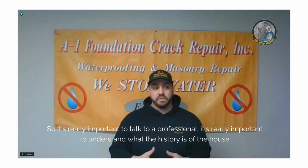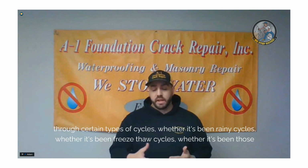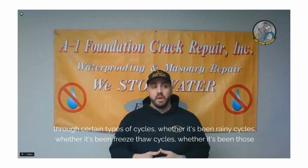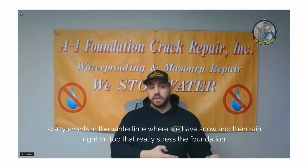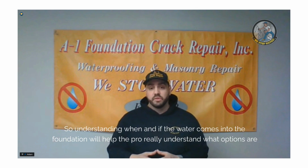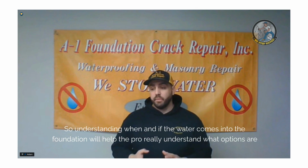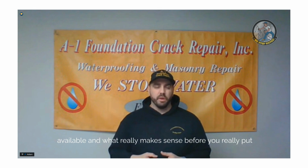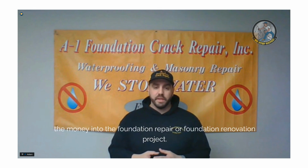It's really important to understand the history of the house through certain types of cycles, whether rainy cycles, freeze-thaw cycles, or those crazy events in the wintertime where we have snow and then rain right on top that really stress the foundation. Understanding when and if the water comes into the foundation will help the pro understand what options are available and what really makes sense before you put the money into the foundation repair or renovation project.